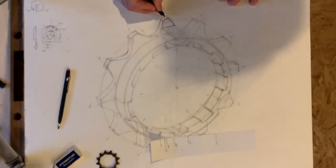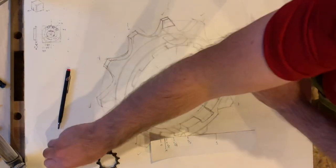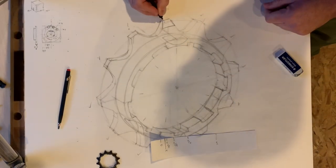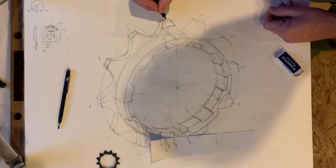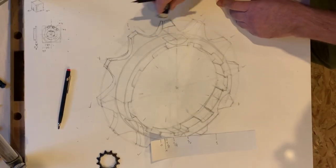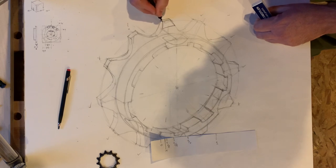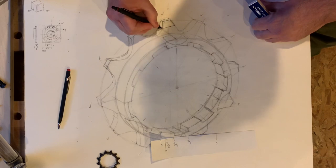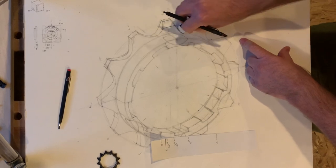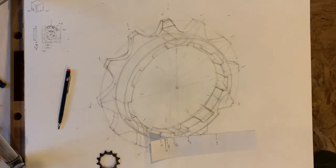So we've got essentially two which have reversed chamfers, one has a really tiny chamfer, and the rest have normal chamfers. I'm going to start switching to my thinner pencil here. Working my way around and almost starting to put some final edges in. About half of the tooth has been removed by the chamfer and it's about halfway down the tooth. I can see I've got a small problem here — I'll just start to tidy that up.